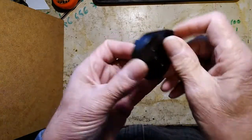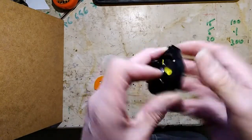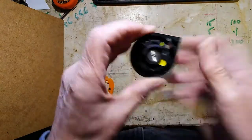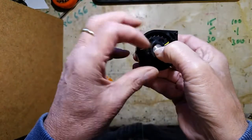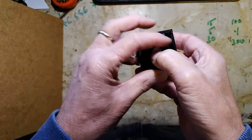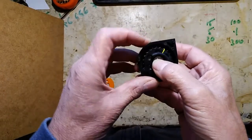And then if you then add the rubber O-ring and the nut on there, and then tighten that up, just nip it, then when it's nipped, you should still be able to freely rotate, bearing in mind that you don't have any actual balls in there at the moment to make it click backwards and forwards.